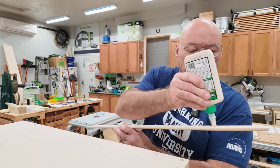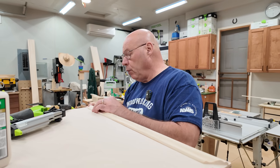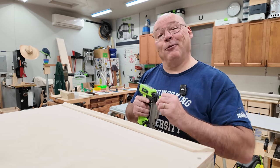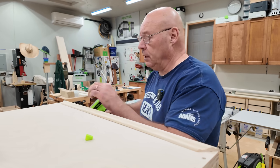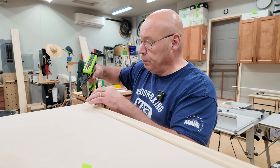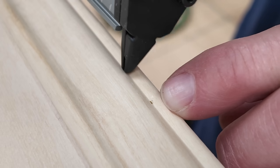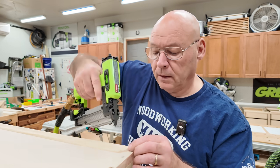Pretty simple — just a little wood glue. I'm going to put it in just like this and bring that long point perfectly to the end. This is a great cut. I truly believe that one of the greatest tools to come out in the last 20 years is a micro pinner, because this is the perfect application. I removed the non-marring tip to get that point, and I'm placing it right here on the molding. While that glue sets up, you can't even see that micro pin — it's 23 gauge, by the way — and I've had these guns for a long time. Perfect.